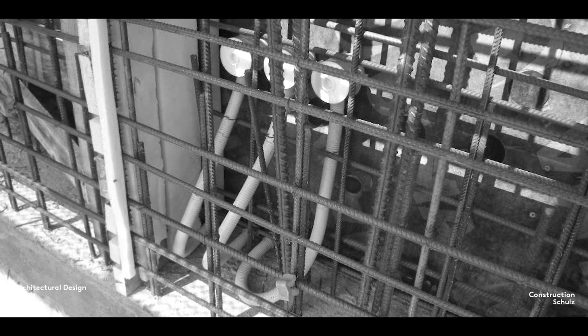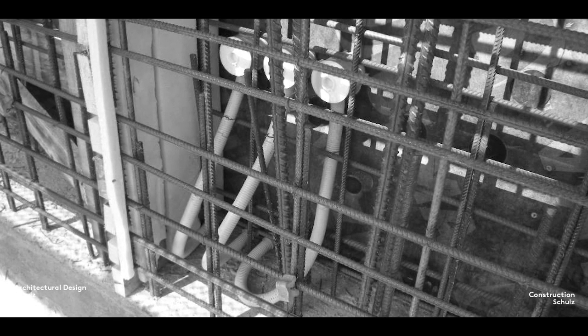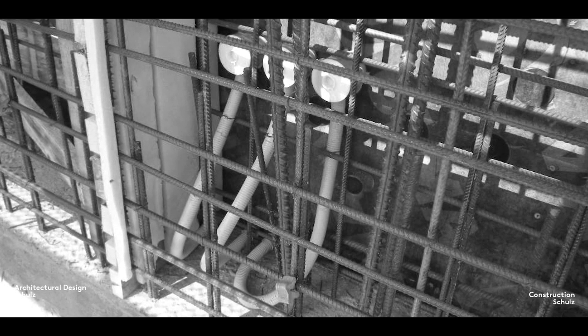Wiring is laid directly into reinforced concrete walls, but because the risk of wiring being damaged during pouring is so great, empty flexible conduits are placed in the formwork rather than the wires themselves. This conduit contains a threading wire that is used to draw the electric cables through the conduit at a later stage.